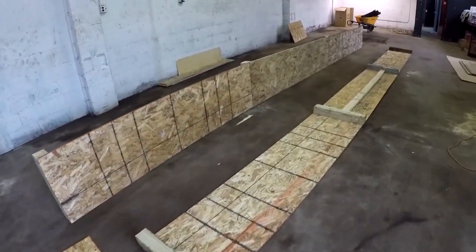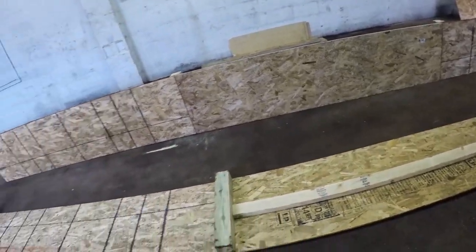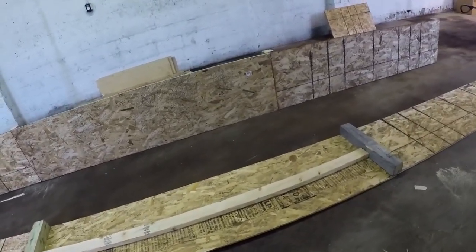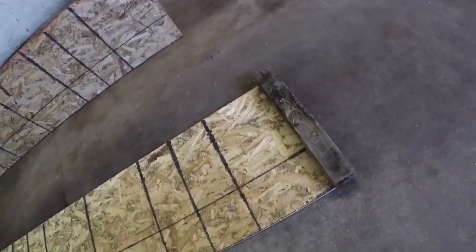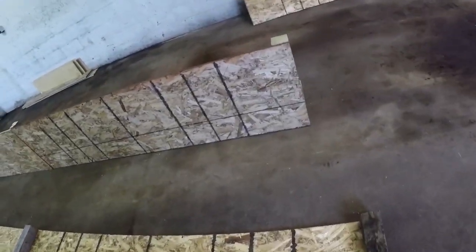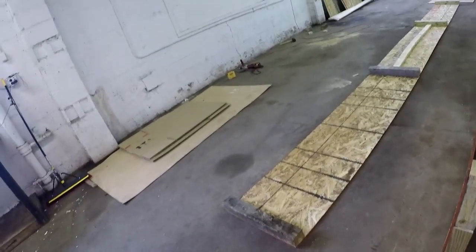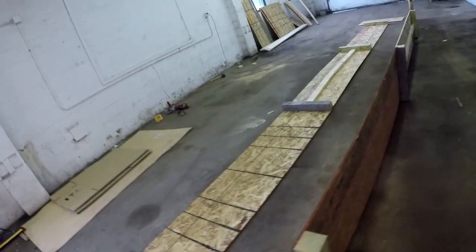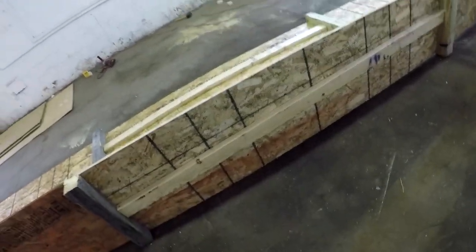It's a hard job. So I had two pieces of scrap wood, not really scraps, but I have these two pieces of wood. So I decided to put them just in the center. Maybe it's a little more flimsy there because on one side they have a wood block, and on the other side they share one block for two panels. Also, the end will have the side panel, so it will be a little stronger. So I decided to put it just in the middle, like that.